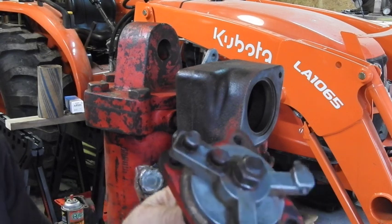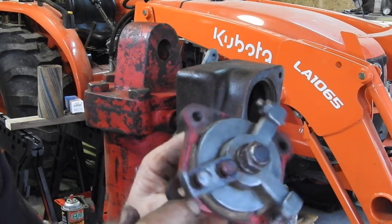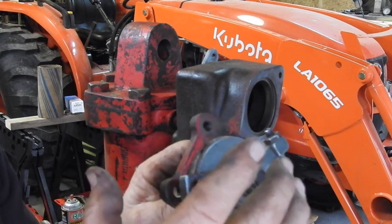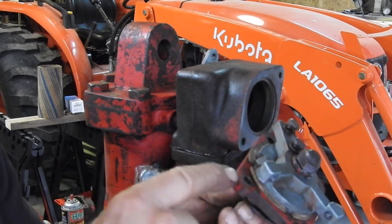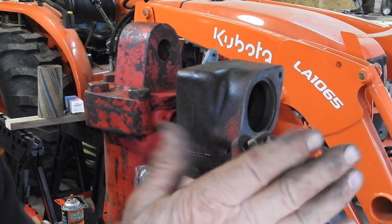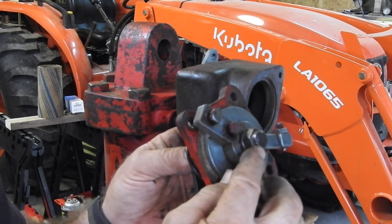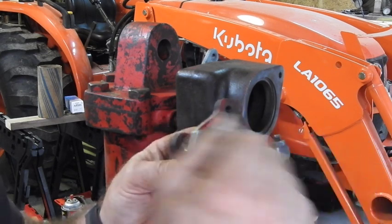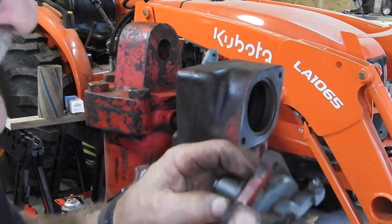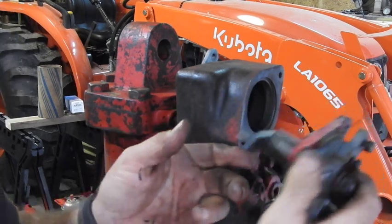There was one other thing I had to make too. Underneath here, if you take a look, you can see a fresh piece of cork. There was actually a dried-up cork gasket underneath there, and so I had to take my gasket cutters and make that perfectly round cork gasket, and then fit three notches into it. That's actually kind of tight right now because that gasket needs to be squeezed in. I've got the lock nut backed off just a little bit, but I'm going to tighten that down and squeeze that gasket, then work that with the quadrant lever, and adjust this lock nut until I get the right tension on it. I'll be right back as soon as I get this ferreted into place.